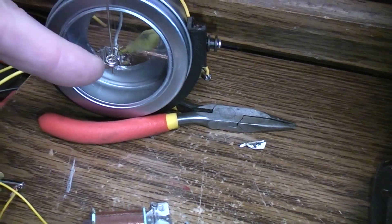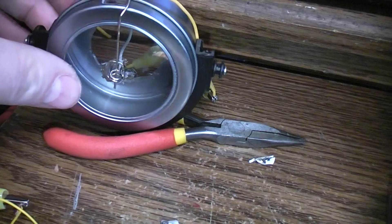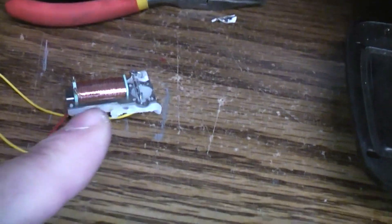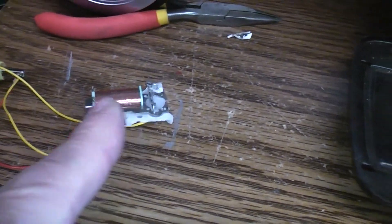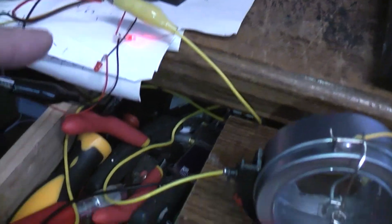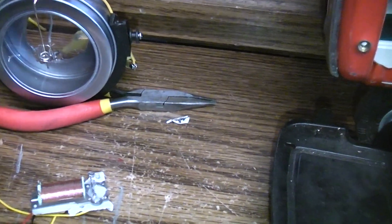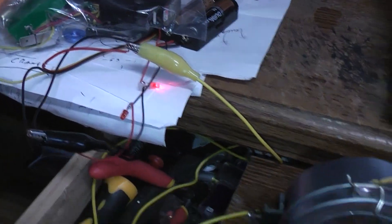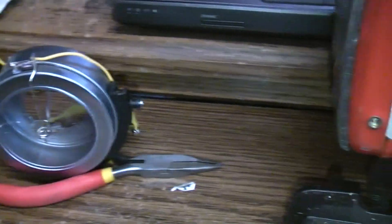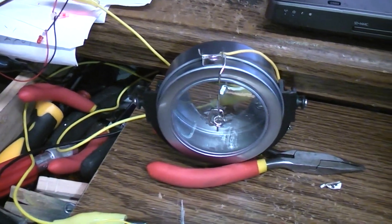I have one contact down here in the loop, and the other contact is the one that's hanging. I have that going to one of my clock coils in a reed relay, which then runs through a battery pack into this LED. The idea is that when I blow this whistle, the vibrations of the dome will trigger it — as you can see, the LED is not flashing with my talking or anything. But this whistle should be closely tuned to the resonant chamber of that Helmholtz.